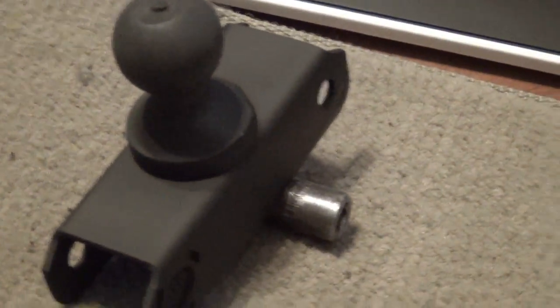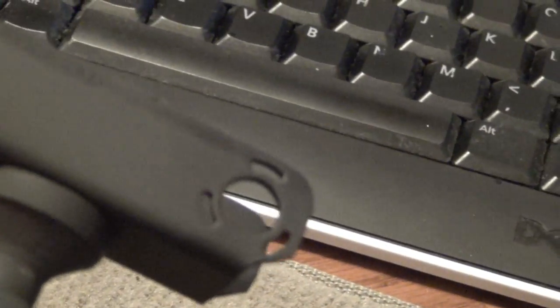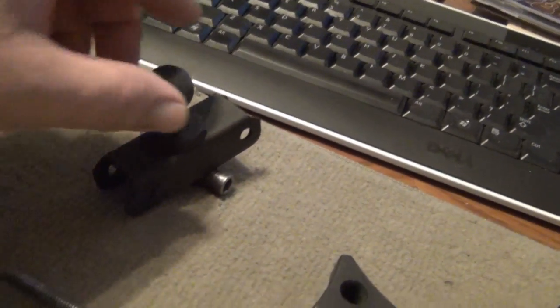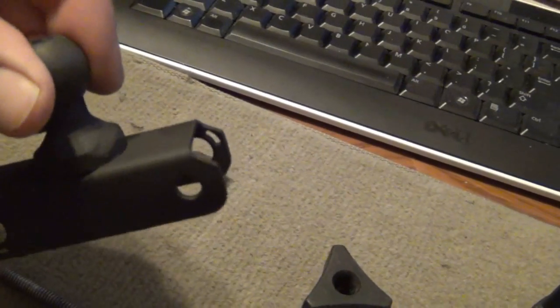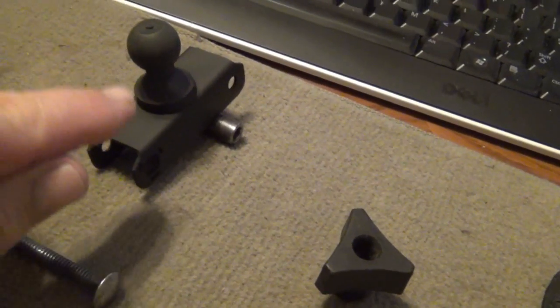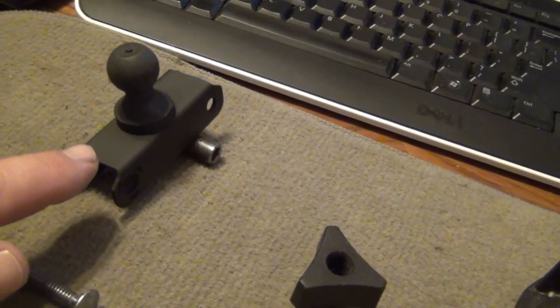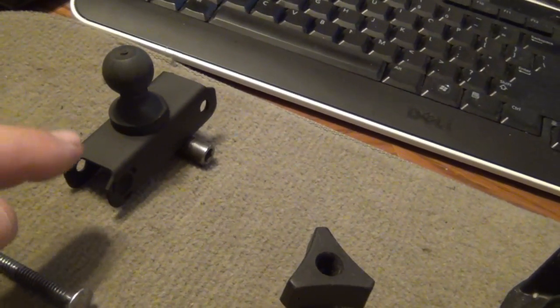Okay everybody, I got it done. As you can see, we painted both sides, inside and out. And what I did was, the first coat I sprayed it with primer, and then I sprayed it with 3 more coats after that of high temperature paint, like you buy to repaint your barbecue grill or whatever. I use that stuff on there. Anyhow, now we're gonna put it back together.